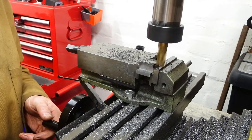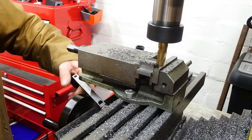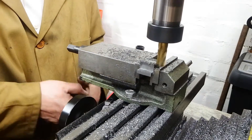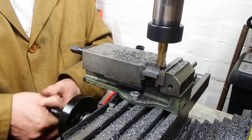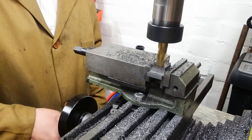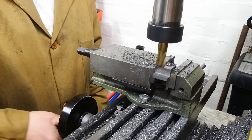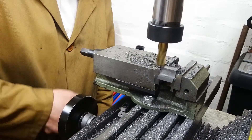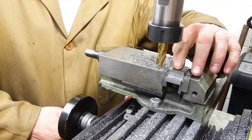This is the lower block piece that's going to go underneath the carriageway. It's only going to have a shallow step in the top just to give it some locating bias on the outside of the block, and a large step on the front of it to get under the carriageway itself. Then a couple of holes in that threaded to M6 to take the two screws.